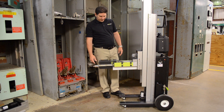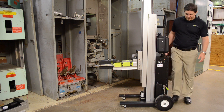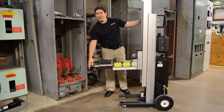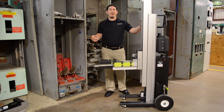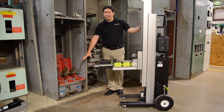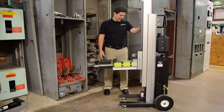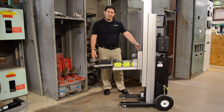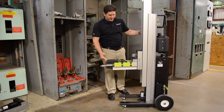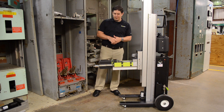We've got double wheel casters — they're grading rated. We've got foam-filled tires, so we don't have to worry about a flat. The motor — I've got it elevated here — but it'll go from two inches off the ground to about 84 inches high. That'll cover most switchgear at 90 inches tall, from very low racking screws all the way up to some that might require a ladder to connect. We have hand brakes on our wheels, so when the unit is racking, the motor moves in a precise manner and the base stays still, even with unlevel floors.